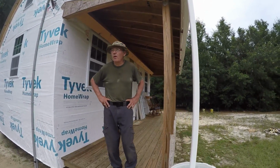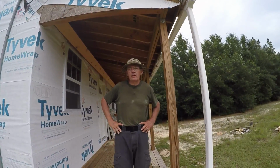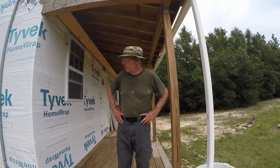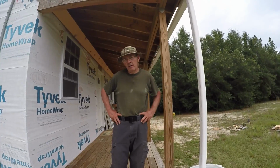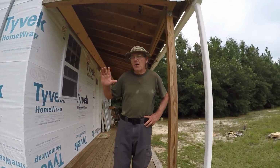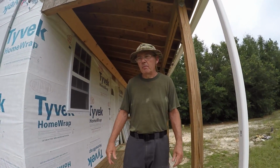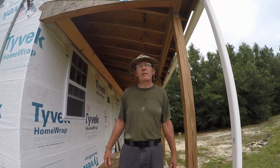In the bathroom. And cool. I put in tees for the eventual kitchen. So we'll eventually have a kitchen. We're going to have to have a dry well for the gray water. Right. Yeah, we've got to find you one of those. But the big deal is that with that composting toilet, you don't need a real official septic system. That's awesome. Because you're creating compost, not sewage.